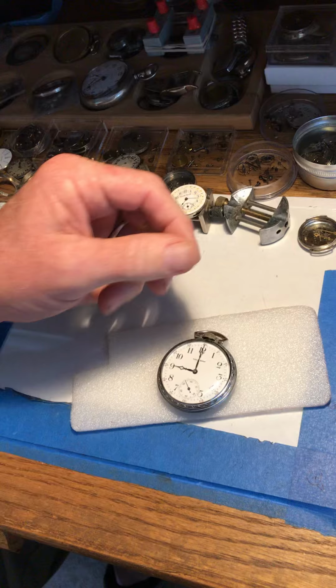and this one is, you'll find, so much easier to wind because it has good ribs on the crown. So wind it till it stops. And this is one that has a completely brand new set from my friend Marty in Niagara Falls, re-blued, restored, and I ordered open frame diamond hands, and they're gorgeous. And let's see, again, set the time, pull out on the crown in the forward direction, don't whip them around. And there you go. Now, you'll notice that the winder on this one is at 12 o'clock.